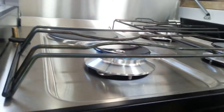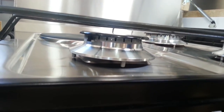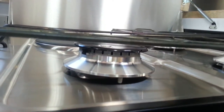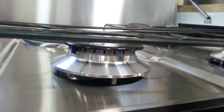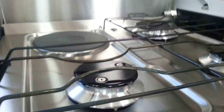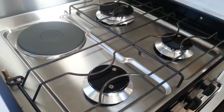Now if we get a puff of wind come through the door which blows that burner out, as I've indicated here, that capillary tube goes cold and the gas discontinues its flow. So it stops, whereby keeping it all nice and safe. There'll be no gas coming through as soon as that capillary goes cold.